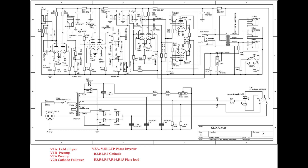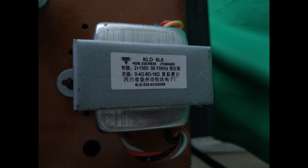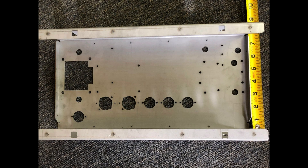However, I did notice an error in how the output transformer wires were connected in the schematic. It seems the specific model or source of the output transformer changed at some point, because the schematic has the green and yellow wires labeled backwards compared to how the actual transformer is labeled. Each wire on the physical transformer came with a sticker label indicating its function, so I just followed the stickers instead of the schematic. Other than those two wires being reversed, the rest of the colored wires were correct.